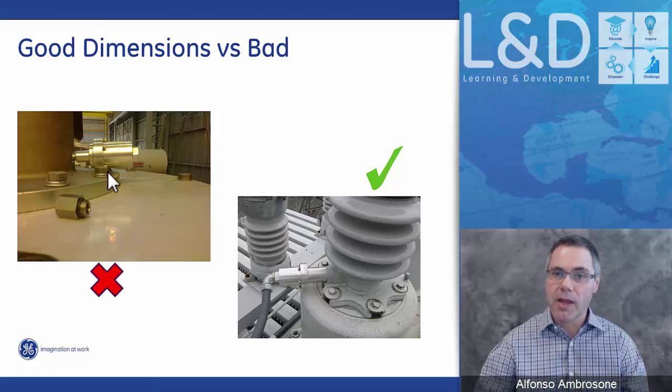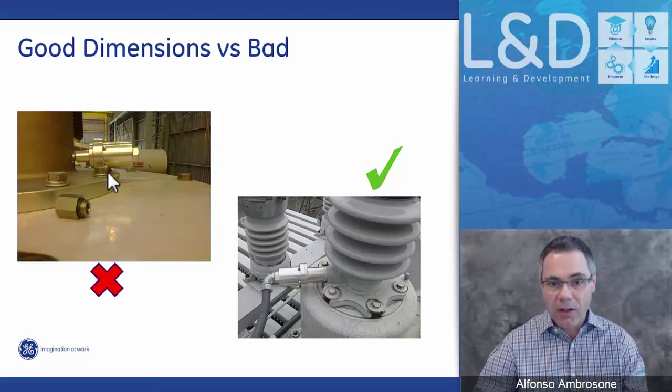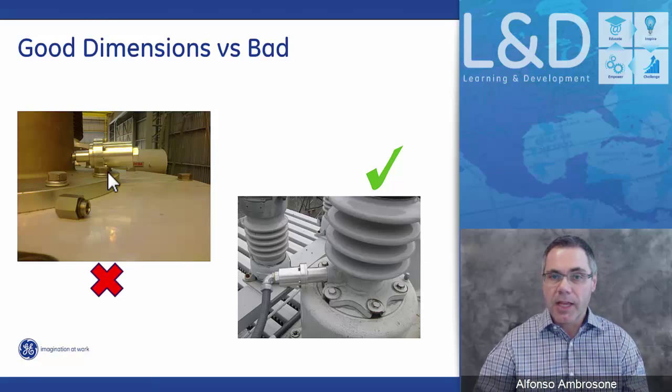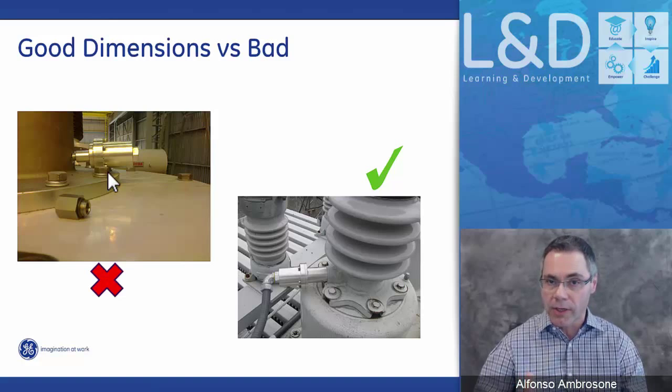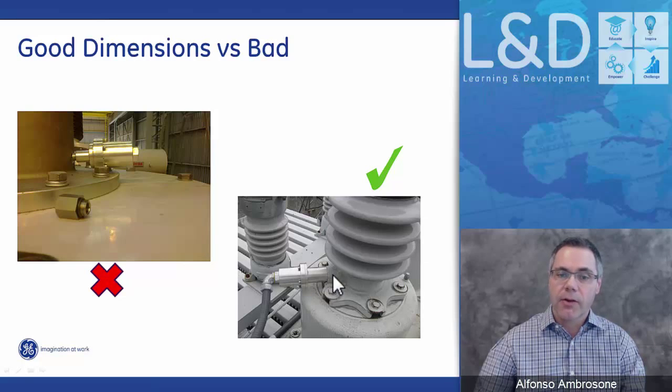The electrical parameters are important for us to be able to design the sensor and for the system to know where the starting point is. But the mechanical adaptation is of utmost importance because we need to maintain the integrity between the center pin of the tapping point all the way back to the electronic enclosure. And the way to do that is to have a full bulletproof connection and integrity from the center pin of that tapping point all the way back to the electronic enclosure.